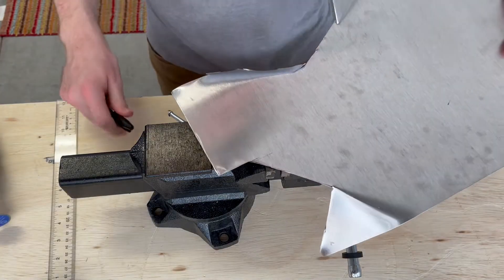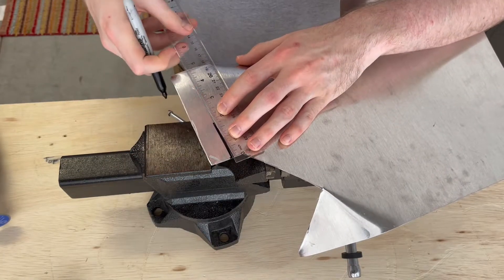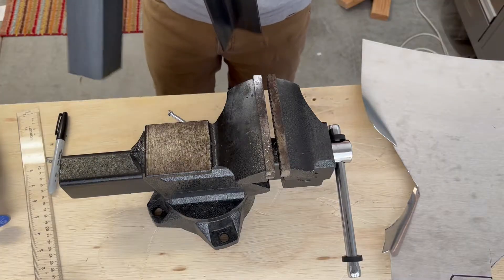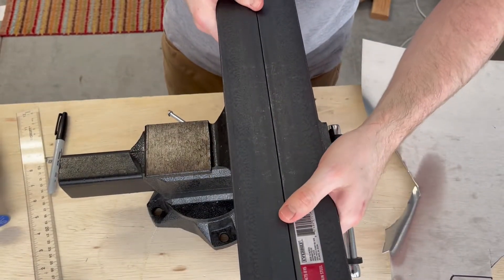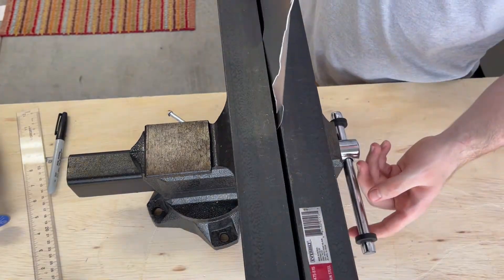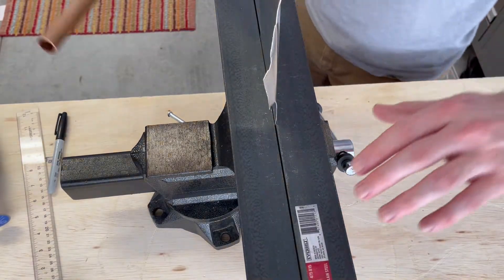And to make the housing, it's pretty simple. I just eyeballed a bunch of measurements and drew sharpie lines on this piece of aluminum. I bent the metal with two pieces of angle iron and my vise, just stuck them in and followed all the lines that I drew, hoping for the best. I used a copper pipe to apply pressure, but another piece of angle iron might have been a better idea — it kind of gave them a rounded edge.